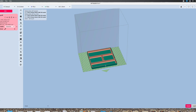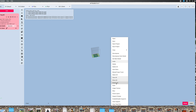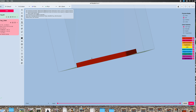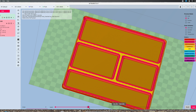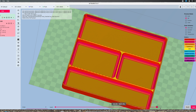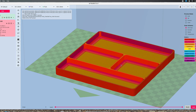It looks like we've got two different colors there — it doesn't really matter the colors on the screen, you can customize that. In this case, it's just going to be extruder one and extruder two. Now we right-click and slice it. That gives us our view, and I'm going through the different layers. The infill is an alternative color — this is very new to me. Let's upload this to the SD card and see if we can get this thing printed.